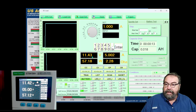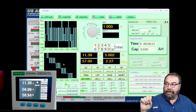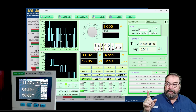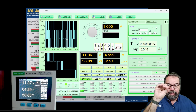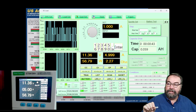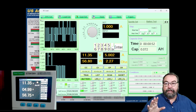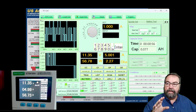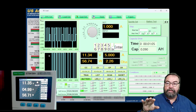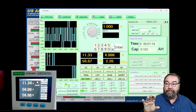So we're running — 5 amps — and we're creating a discharge curve. One thing I've noticed about this software is that the graph auto-scales. So here is our amperage, and instead of a nice flat line on a scale of 1 to 10, you see this up and down because it auto-scales as it goes — super zoomed in. Kind of dumb. Over here on the voltage curve you see the same thing. I haven't found a way to turn that off. Theoretically it's saving this as a text file, so I can pull it into something like Excel and graph the time and discharge curve.